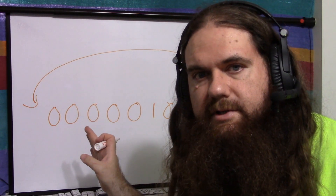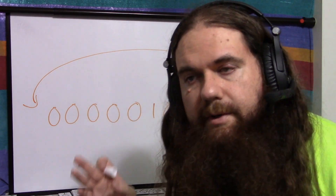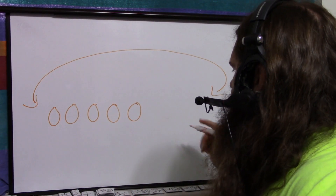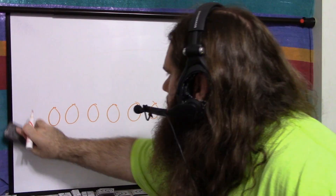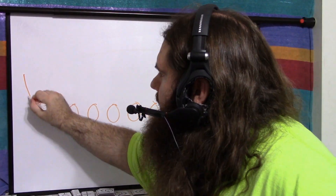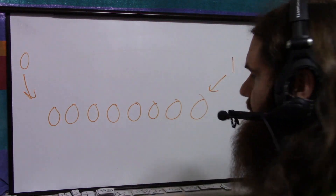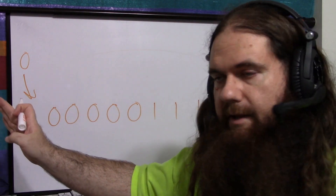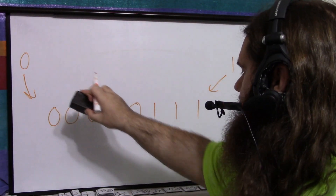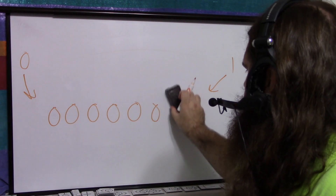The wonderful thing about digital electronics is you can plug things together like Lego any way you want. But here's another trick: instead of making it circular, what if we hard-connect a 0 on one end and a 1 on the other? Then every time we shift one way, we add 1s; and when we shift the other way, that end feeds in 0s, so the bits go back to zeros.